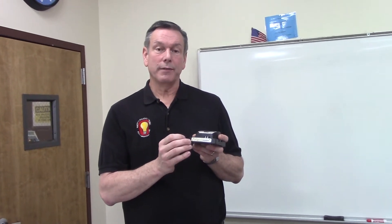The next model would be the 7505P, as in Papa — 1515. You might ask: what does 1515 denote? That would be a 15-second pre-purge and a 15-second post-purge. Just to backtrack: the 7505A would be quadruple zero. Put the zeros in pairs — no pre-purge, no post-purge.